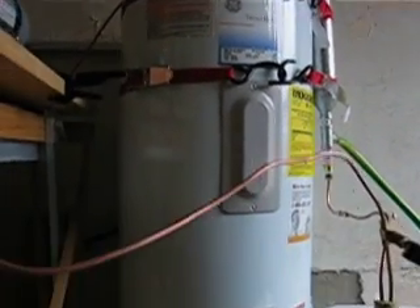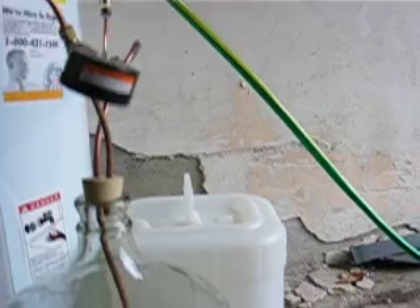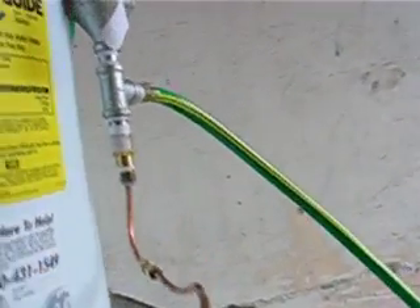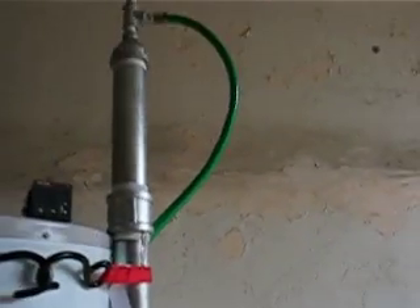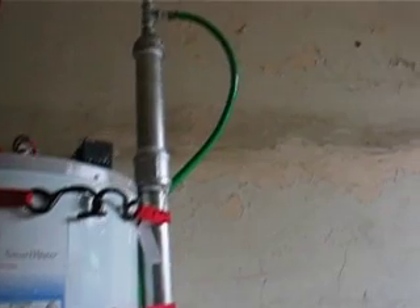What I'm going to do now is turn on this vacuum pump, which is then going to basically create a vacuum in this carboy that we can read on this vacuum gauge. From that carboy it's being fed through a copper line through this heat exchanger, which is kept cool by a water feed from a garden hose I have outside.